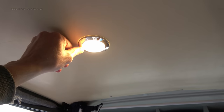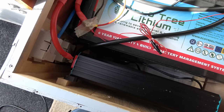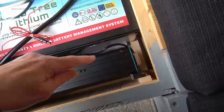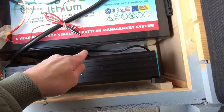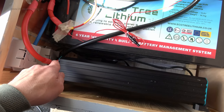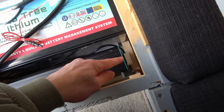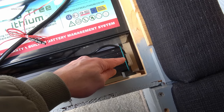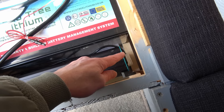The fact that the lights are still working means the main fuse has not tripped. I'm just wondering whether in the plug that I ran from the inverter just over to my socket there, I wonder if the fuse in that has gone. The inverter's fine, everything else seems fine. I wonder whether I've got actually just a silly little three amp fuse in that, which might have blown instead of whatever 2000 watts needs.